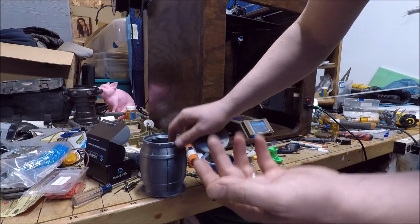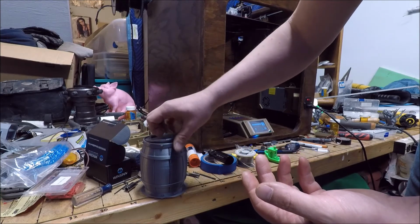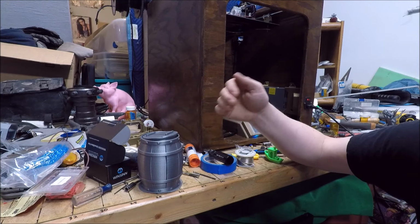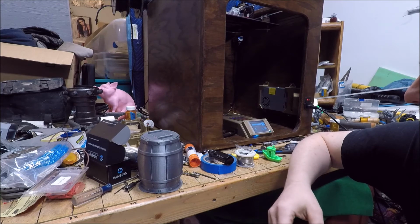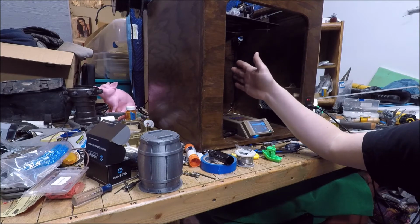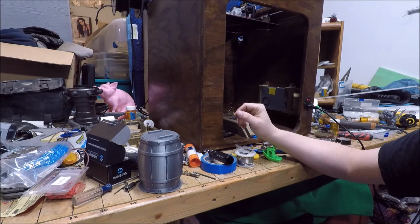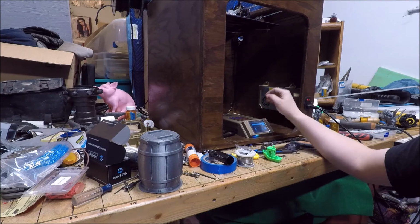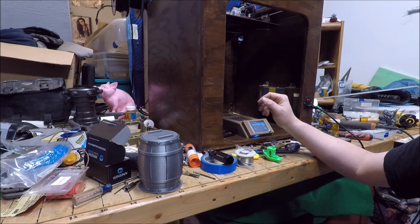And this being a Titan Aero for the extruder, it's a direct drive, so I don't have some of the tuning issues associated with a regular Bowden setup. Yeah, so overall I'm really happy with the design. There's a few things that are going to get changed. Like I said, the bed offset's going to need to be a little different. Probably going to end up flipping the spool and the power supply. Pretty happy with this control box, though I might tweak it a little bit. If I end up changing displays, that'll probably definitely be a change.